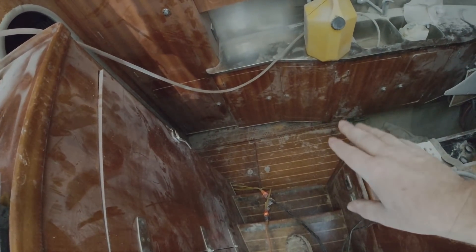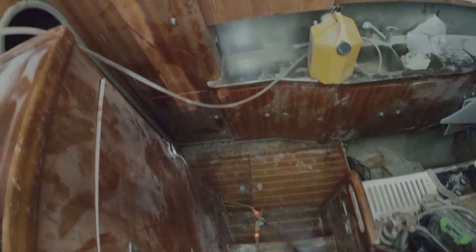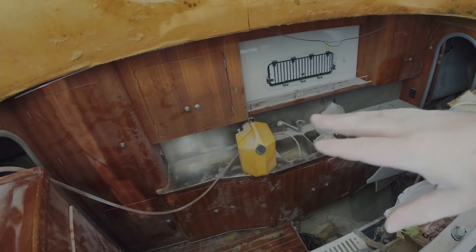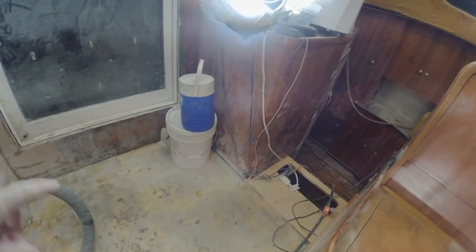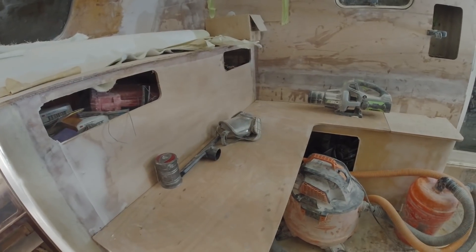The only bilge I haven't cleaned is under here — I did pull the engine out, so the engine's gone, and I'll clean that bilge tomorrow. This side of the boat is in fairly good shape; I'll probably do a little painting and restaining with no real structural work over here except for a little bit on the outside of the bathroom. I've got this subfloor piece — I need to finish the subfloor; it gets raised up three-quarters of an inch and I'm going to raise it with some stringers. The desktops — I'm actually not going to use plywood for those; that'll be a surprise I'll show down the road. And I've got the area all ready for my new Blue Sea Systems 360 electrical panel, which will be recessed in there, with a removable panel with a push-lock and a hinged door.